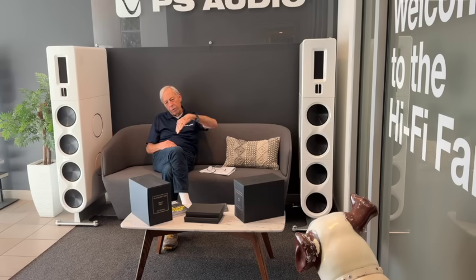The crossover rolls off the top of the woofer and rolls off the bottom of the tweeter. When you do that, the two have to intermingle so that at some point they're crossing over each other — the tweeter is doing some of the bass and the bass is doing some of the tweeter. That point where you blend them together, you don't want to hear that seam. Kind of like sewing — you want an invisible seam. Some people really want just the simplest crossover, 6 dB per octave, just simple slopes.